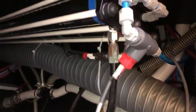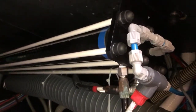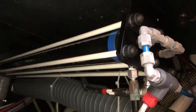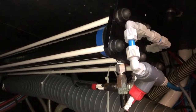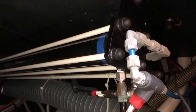Re-hook up everything as before and make fresh water. I noted it took about five minutes of running before the parts-per-million came down — at first it was around 900, ultimately dropping to around 150 after about five minutes or a little more. Hopefully this helps you. Leave any concerns, questions, or comments in the comment section — thanks so much.